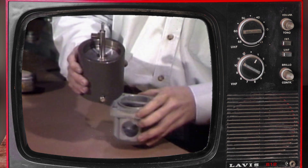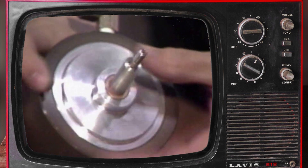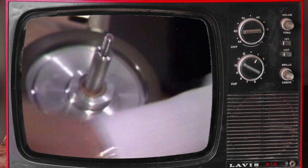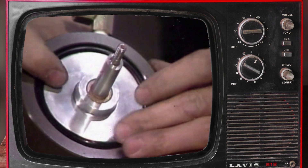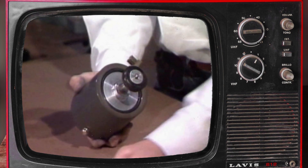Lift the assembly free of the cap. Install the lower rod guide and o-ring, then install a new valve plug and o-rings. Place the lock nut and washer on the shaft and thread it so that the tip of the shaft appears above the nylon bushing. Note: the valve plug will not seat properly if this nut is over-tightened.